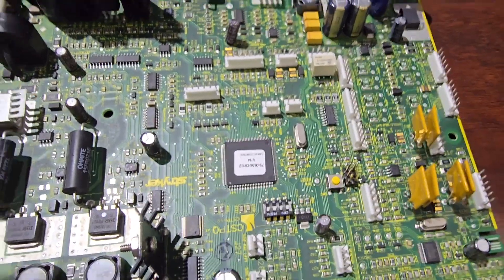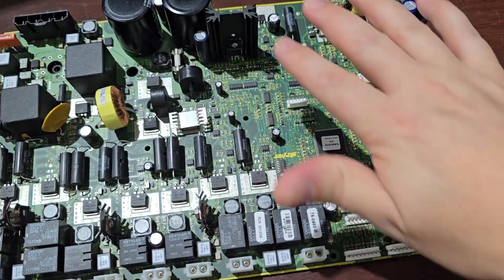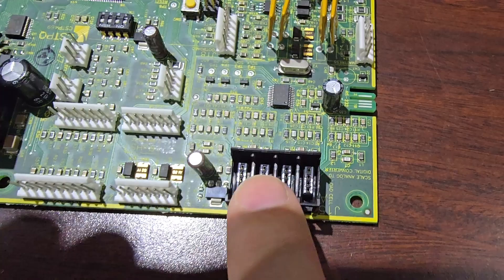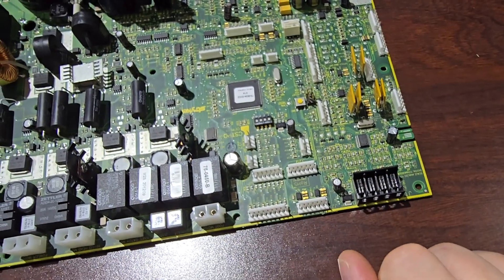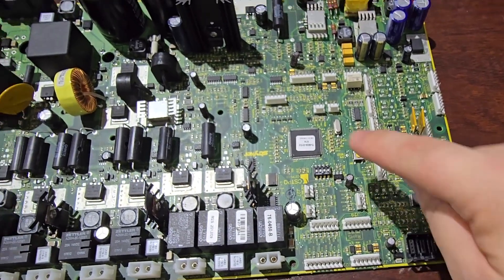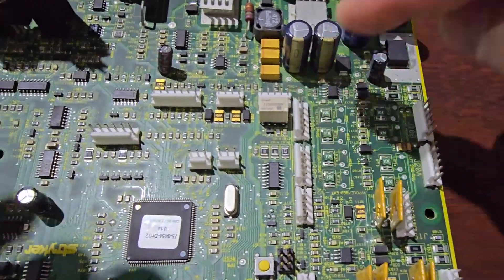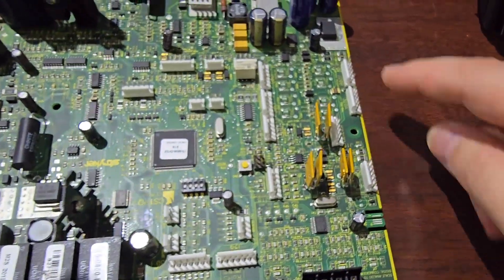Notice the orientation: we've got all the power happening here, all the motor switching happening here, and over here is the actual computer. So if you're having a problem with the bed rail or with the scale — here are the bed scales, with the smallest size conductors, because this is just a very minute DC that comes in. It takes an analog-to-digital converter, converts it to a digital signal, and now the computer knows what it's dealing with for a calibrated measurement. All these pins right here are where you would take your measurements if a certain feature is not working or if there's a certain error code. The size is a big indicator of the function of the port.